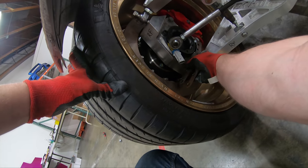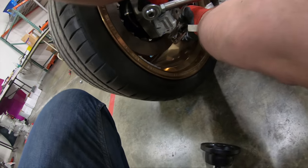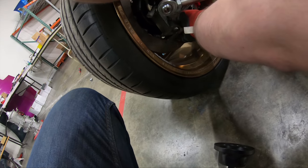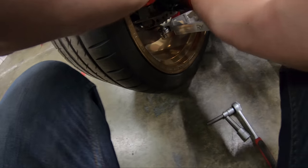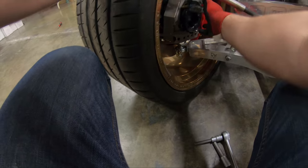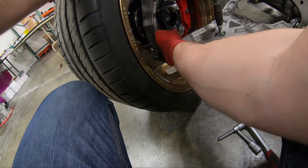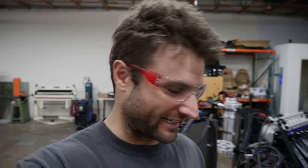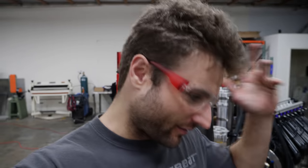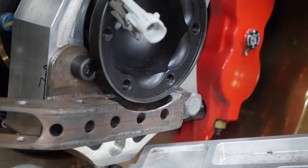Hilariously, that's actually pretty close. For those of you who mentioned that bolt head was hitting the flange — it wasn't. It actually hits on the inside here where it's supposed to. It may not hit on the top one but it's now going to hit on the bottom ones. The correct solution is to change how this mounts to this upright — take down the bolt heads, add another mounting point down here to keep it safe. Taking the heads of the bolts down was a four-in-the-morning idea. I decided quickly after I turned the camera off — no, let's actually get shorter bolts. Those are very tall-headed Allen bolts and you can get normal standard bolts instead. It turned out pretty decent.